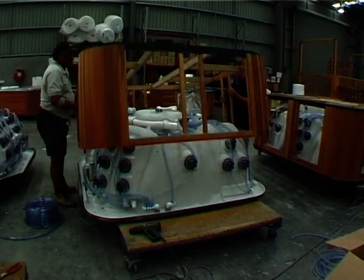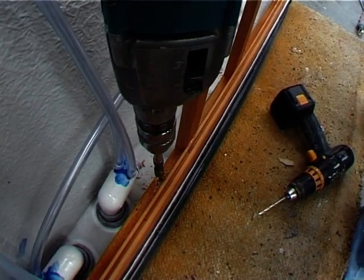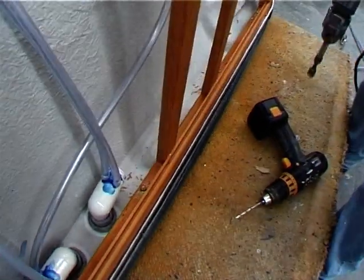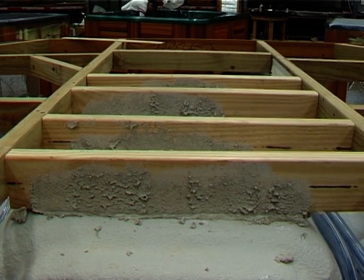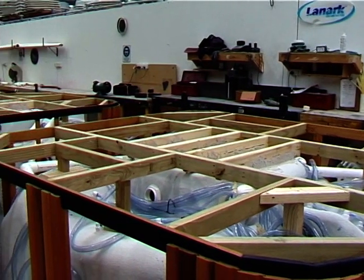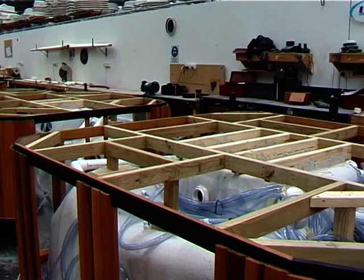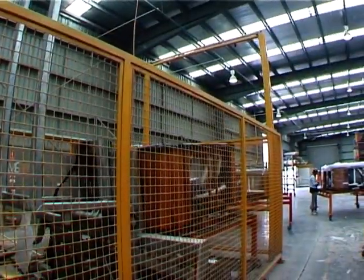The cabinet is then placed onto the spar and screwed into the wooden support beams that we saw being glassed during the spraying process. A sawdust and resin compound is added to the base of the cabinet, gluing the base of the shell and cabinet together to prevent movement between the two and enhance rigidity. The spar is now flipped and the rest of the equipment attached.